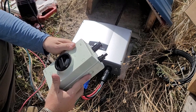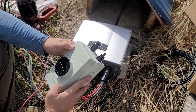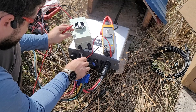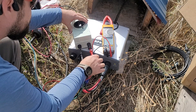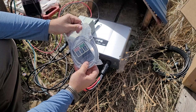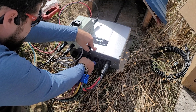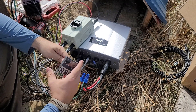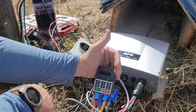To run it off of solar, I want to have this DC disconnect. Because we're working with high voltage, it's always good to have some form of DC disconnect so I can turn off the solar input when I need to work on this. I put the probes in incorrectly at first so I thought I had done something wrong, but everything was perfectly fine — you just have to go male-female connections. This little screen controller tells me if there are any errors or issues with the whole system. It plugs in with an Ethernet cable and tells me all the hertz, how much power it's pulling — everything I need to know. We can see we're basically up to 60 hertz AC output, which is what we want here in America.